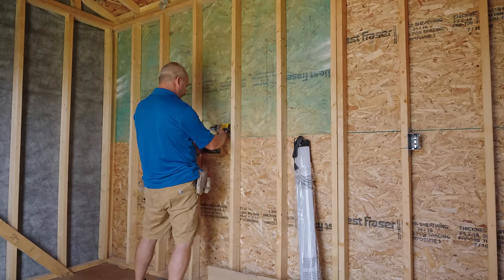That is for another day, and this wire is causing me all kinds of frustration, sticking out because of that coil action. Remember, code requires a staple within 6 inches of leaving a box. And depending on where you live, you might even be allowed to put two wires on that. I prefer to have individual staples for individual wires. Come on, honey. Just call me old-fashioned, but... all right. Now we're good. Time for the last box.